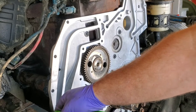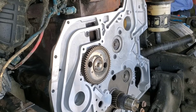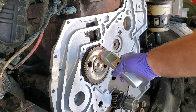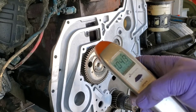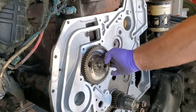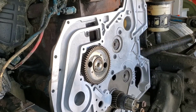I walked away for about six or seven minutes to go grab a few tools, and just to show you how quick that thing cools down — we went from somewhere between four hundred and four fifty down to one hundred degrees. That's still pretty warm, but you've got to be fast when you put that thing on, because the rest of that metal just starts pulling that heat and absorbing it, and it just cools down that fast.